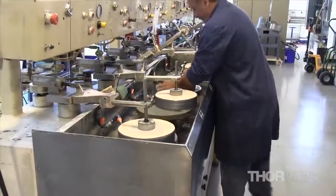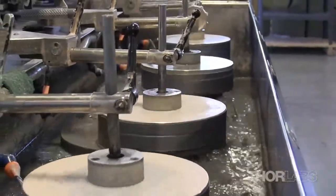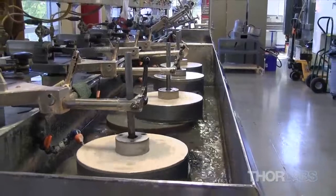The cleaned and beveled glass blanks will be re-blocked and go through several more rounds of grinding using progressively finer grits or loose abrasives to further adjust the thickness of the glass and the parallelism of the surfaces.